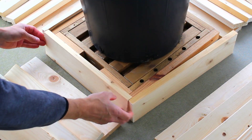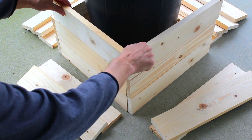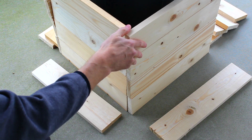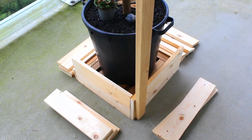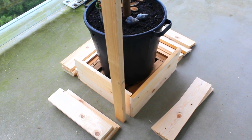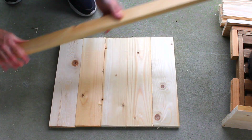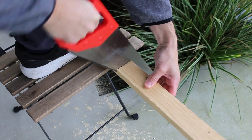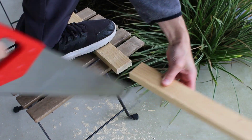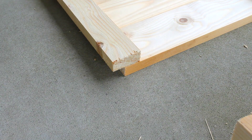I'm just going to mock up the pieces so I can see how they'll all sit together. The panels will be constructed using vertical edge boards that will come together to form the corners. I'll first lay out the boards, measure the edges, and then cut them to length. Because the corners will also overlap, I'll need to leave a gap that's the thickness of one edge board.